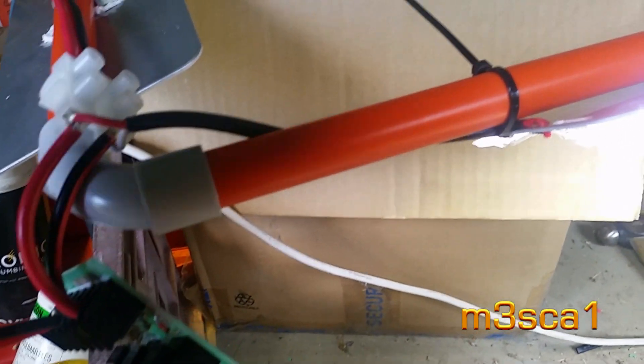So they're the cool whites. You've got a lot of strobing there, and that's purely because this thing is running with pulse width modulation. With this PWM I can also adjust low-voltage dropout and frequency. I'll just show you dialing it down — that's some terrible strobing. If you were using this as a video light and you didn't want the strobing, you'd just put a great big capacitor on there and you'd be able to stop that happening.